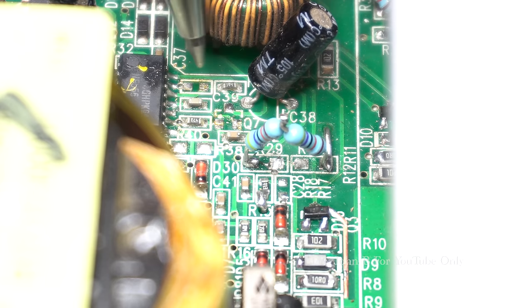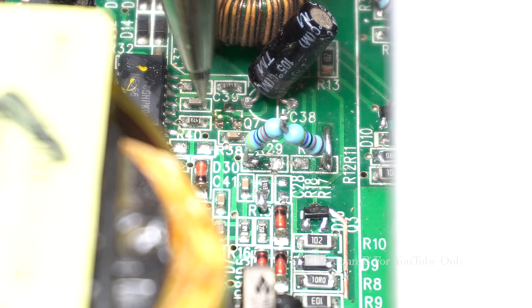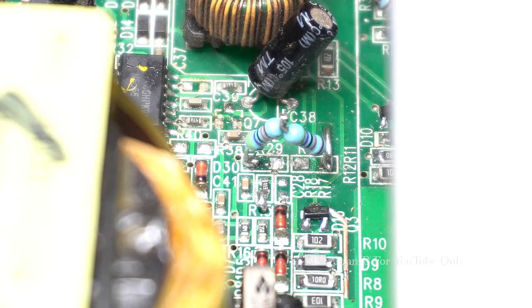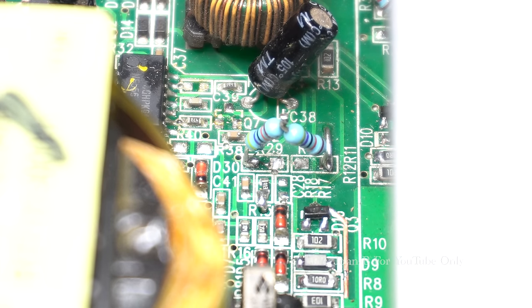That's the discharge resistor just in there. That's the capacitor it charges up. And the transistor is just down here. And it was a wrong sort. And you can see one of the bodges. But if it bodged it and fixed it, then that's all well and good. But some of the bodges have repaired most of the power supply, but we've still got this issue with the limit because it hasn't been done properly.